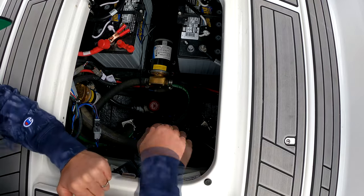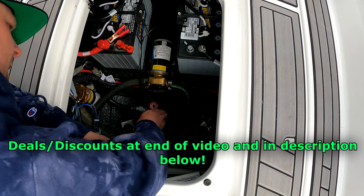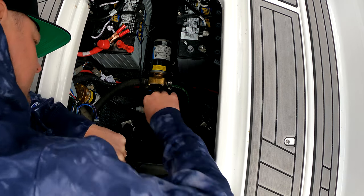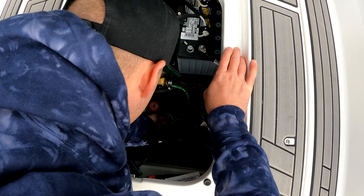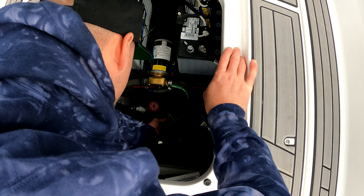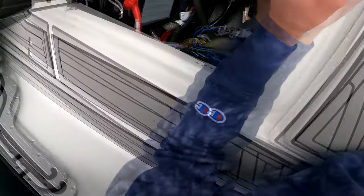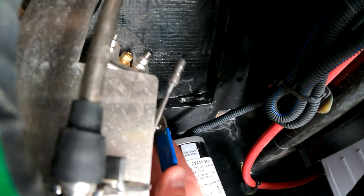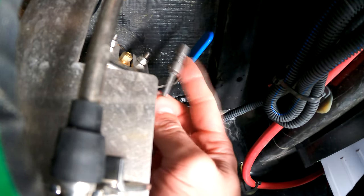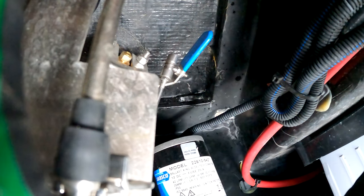I'm going to start off with hooking up those actuators on the valves for the ballast pumps. These guys right here kind of move in and out, and they need to hook up to this. So I'm going to try to get you down in there to see the next one, because it's probably really hard for you to tell what I'm doing. So I'm shutting the valve like that, and then this thing just needs to hook to the end of that. You've got to pull this sleeve up because that's what locks it on and keeps it from coming off.